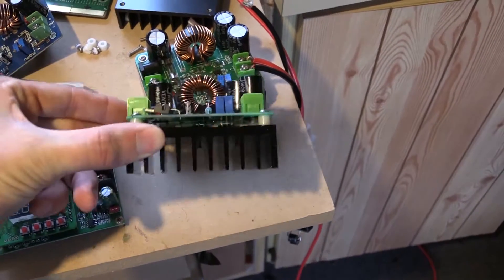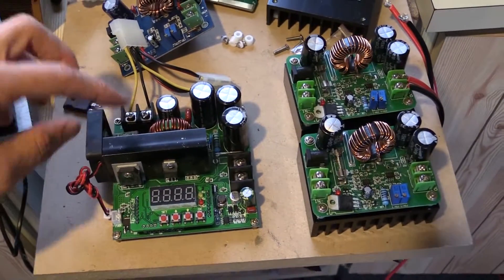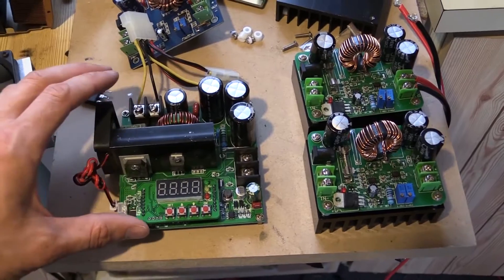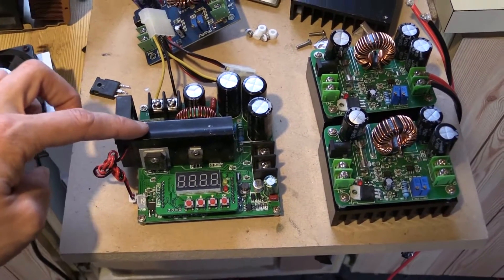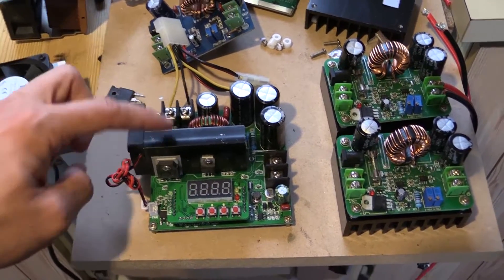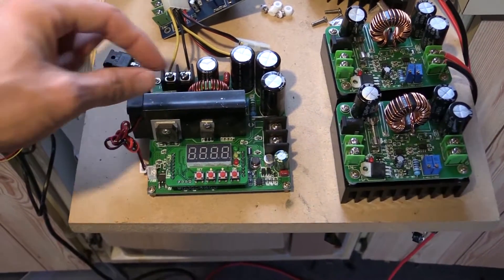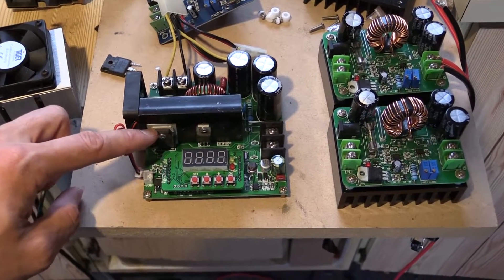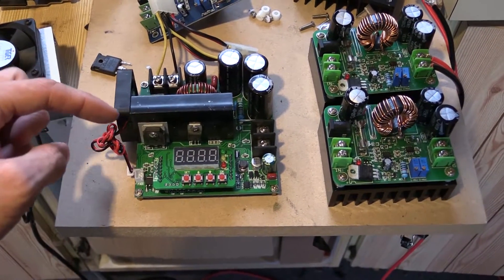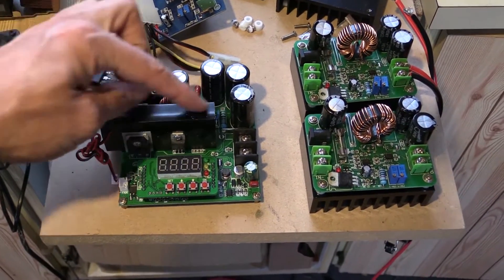This 900 watt unit uses a much thicker and heavier heatsink compared to the very thin heatsink on the cheaper version. It goes up to 120 volts on the output, and I'd highly recommend this unit — it just works really well. However, if you're trying to use it at high current or near its current limits, the cooling is just not good enough. The power MOSFET got way too hot and ended up popping — no smoke came out, but it stopped working and blew the fuse. So this unit is going to get an upgraded cooling solution.